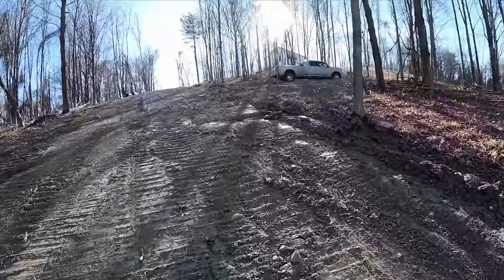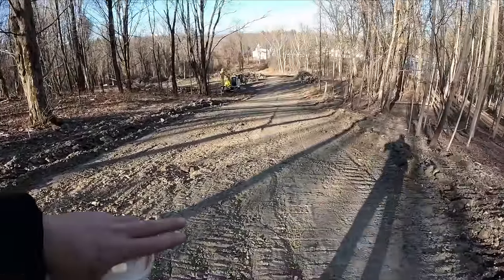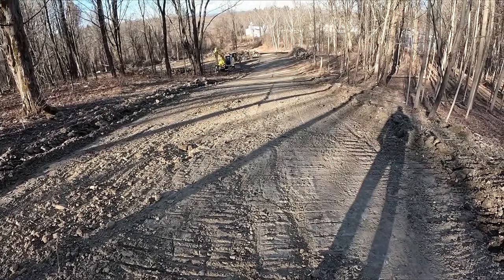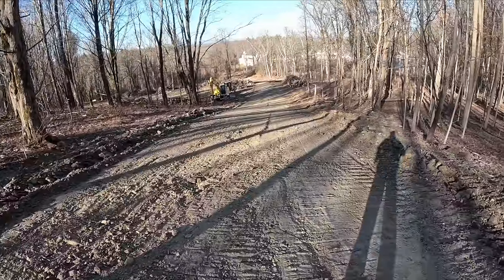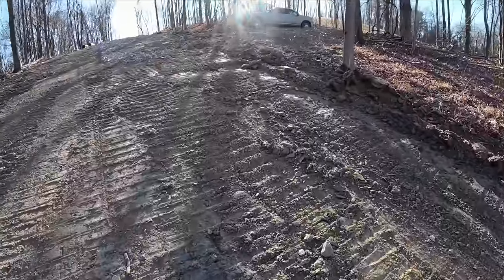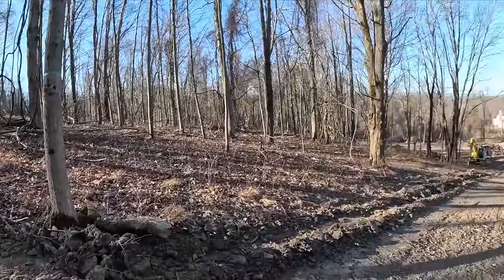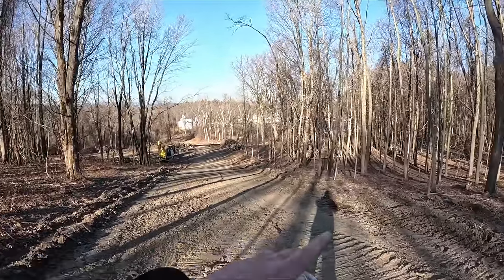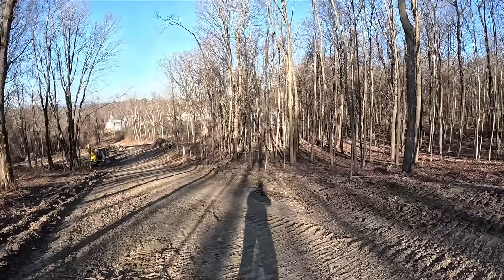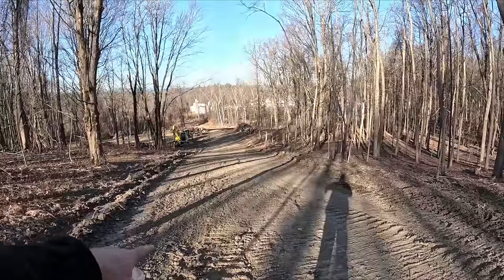My concern is, we have to hit this. This has to be this thick anyways, but this was scraped down once before and the overburden was out, but I'm not sure. Like I said, I didn't start this job. Typically, I'd box this down a whole foot, but all the stuff is down there, so it might have been already. I'll have to check, but I think that tree's got to go because we have to put a culvert in there at some point. But again, this is probably 20 feet wide and will only be 12, so if we're up 2 foot, you automatically got drainage, no doubt. But I'd like to knock this roller out right here.